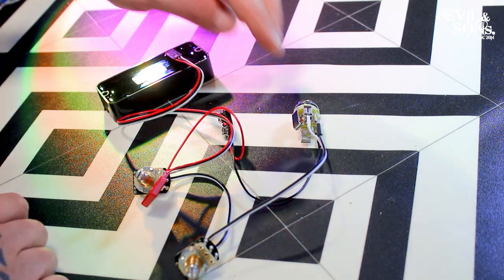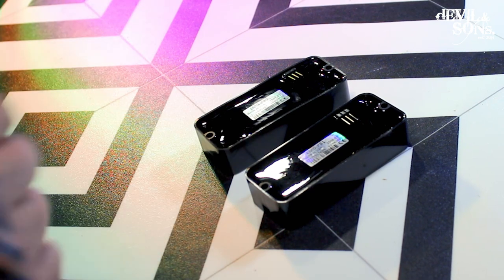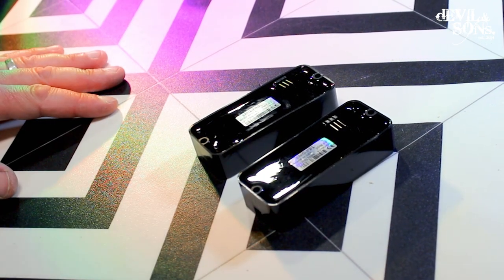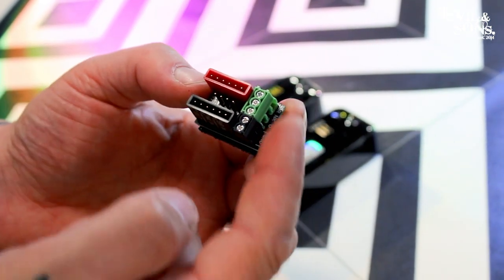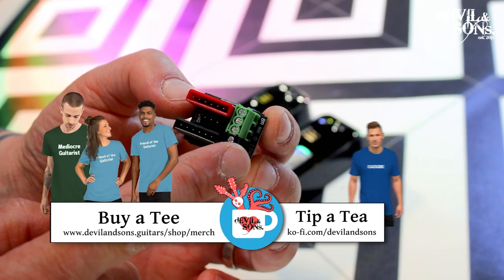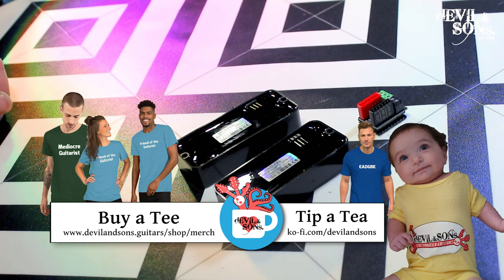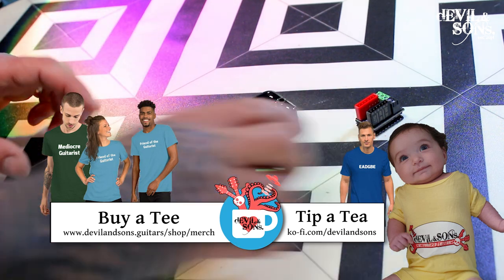Here we've got the output going to the bottom two lugs of the tone, with the arrow indicating which one's the ground — so the black one needs to line up with what says ground. Now our circuit's broken because the tone and the volume aren't connected together, and there's a simple wire that connects those up. It's exactly the same setup as before — the black is the ground, so we line the black on the tone ground and the black on the volume ground. And there we have it — our new wiring setup with volume and tone, so coming out of the pickup, into the volume, via the tone, it goes to the output. Once again we've got the battery to power the pickup and to go through to the output jack as the on/off.